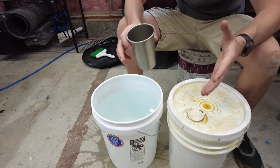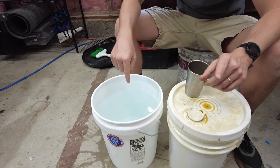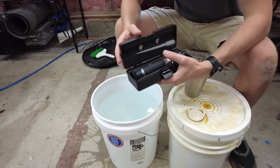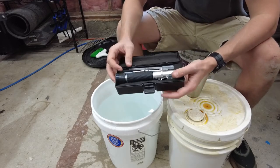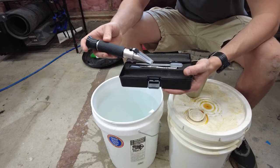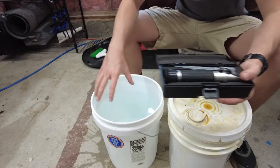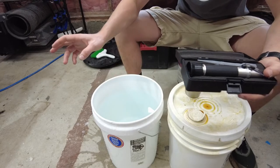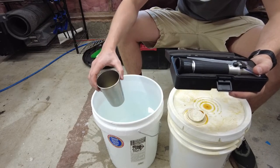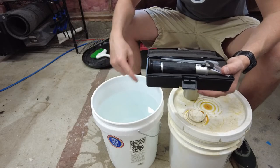To achieve that 8%, I'm not using measurements of how much I put in — the problem with that is it's ever-changing when evaporation is happening. What I have here is a refractometer — it's pretty inexpensive on Amazon. It's a little kit with some pipettes and this little device. Beer makers use this — it's a common chemistry item. Using refraction, it'll tell me the percentage of coolant to water. Mine actually goes only up to 10%, which probably isn't ideal, but if I'm shooting for 8% it allows me to dial that in.